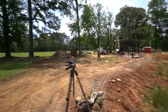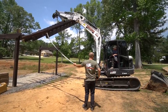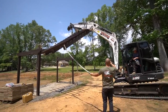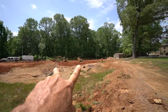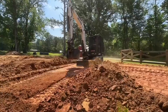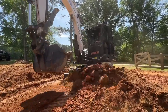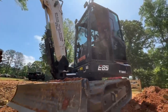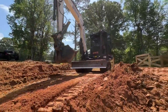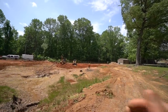What happens is we have all this groundwater coming up, we have water on top, and it creates this imbalance. In certain situations it will cause the liner to actually bubble up — I've actually seen rocks the size of cars floating on top of rubber membranes because of the power of hydrostatic pressure. So what we need to do to alleviate that is make sure we constantly have a drainage system flowing by gravity as well as a pumping system. This is the number one issue. Along with the obvious things — moving all that rock, clearing debris. We are making incredible progress: all our rocks are staged, the equipment is ready, the pergola is coming down, and we've got a majority of the water out.